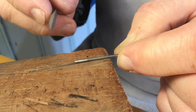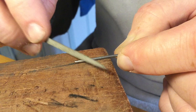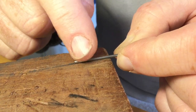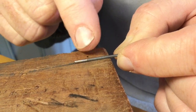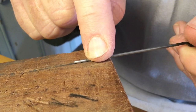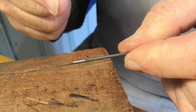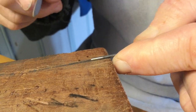I'm filing at an angle, which will put scratch marks in it in a similar direction to a screw thread. So you can actually twist it into the brass and give it some extra purchase and grip.